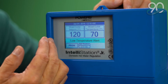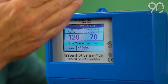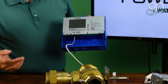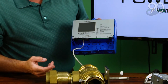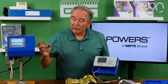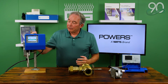Go to home and then wait. There's no water coming through here right now, but typically in a couple of minutes you'd see the valve move and get to its set point temperature, and you're all done. For facilities, if they want, they can wire a BMS connection to the valve and have reporting and control on it, or they can just download the app and get all the reporting, monitoring, and alerts from the valve wirelessly.